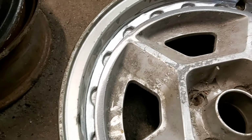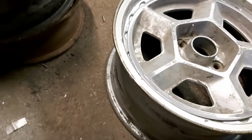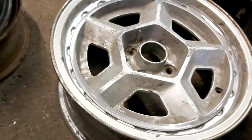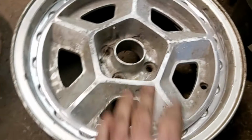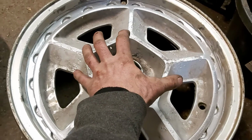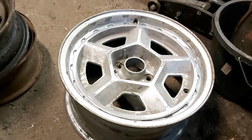Parting this now is going to be a major pain, because what I've got to do is stick this in the fire, get them as hot as possible. I won't be able to do it on the oven ring. I'm going to have to put this above a flame, get it beautiful and hot, and then lift it by the center, pour water on the center, and basically it shrinks that and it just drops out. But I tried smacking it out with a hammer. Obviously that doesn't work, but yeah,